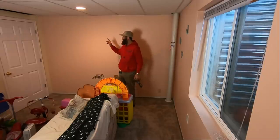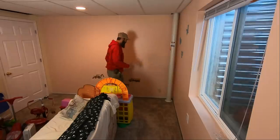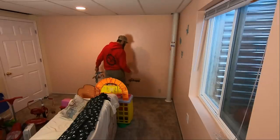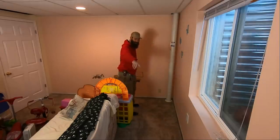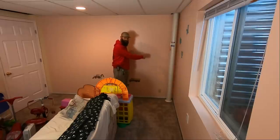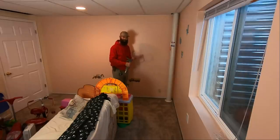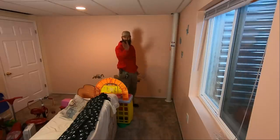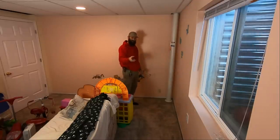For this wall here, I'm going to measure from that wall to this wall, cut it to length, spring load it in here and put it in. Now this long run here is going to be a 12-footer. I'm going to cut the profile of the baseboard with a coping saw — real quick and easy to do. On that end, I'm going to cut a 45 so that the next piece slides right into it.